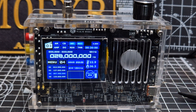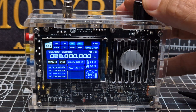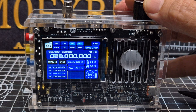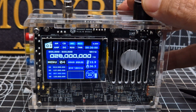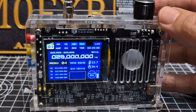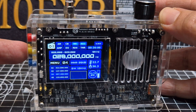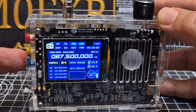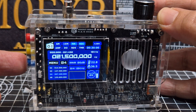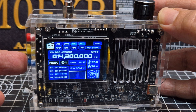If we stay in menu mode and then turn the black knob — remember to turn the device on and off by holding down the black knob. As we turn, you'll see it's moving along: CB, noise reduction, AGC, amplifier. When you're in menu mode and you go to CB, you can go up or down. Just look at the word CB changing: shortwave, 9, 15 meters, 17, 20 meters.